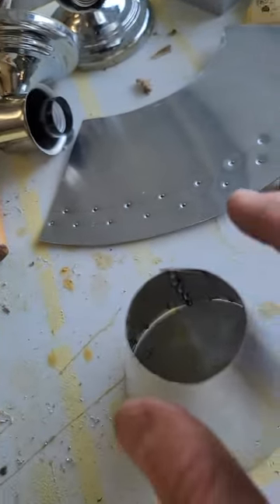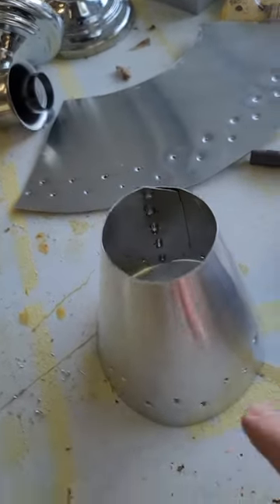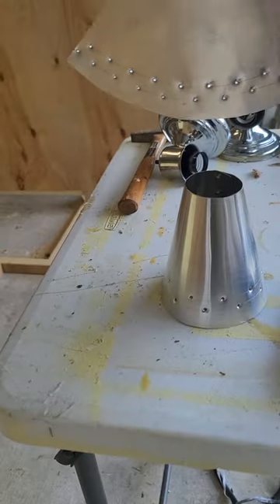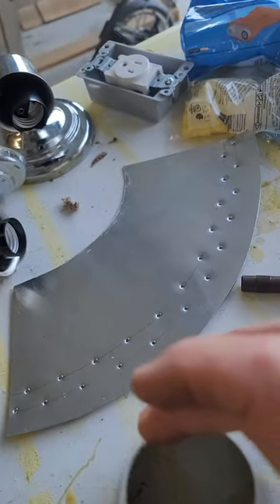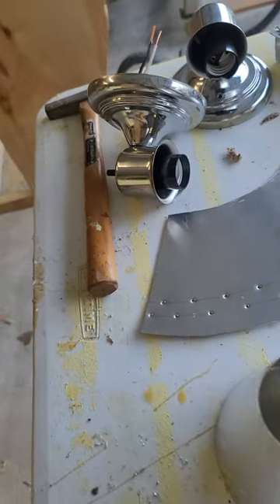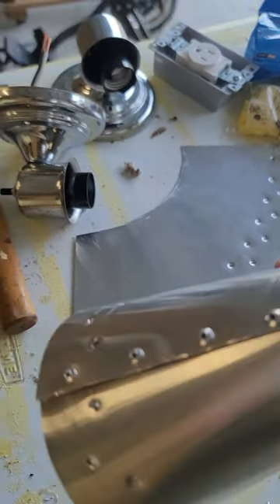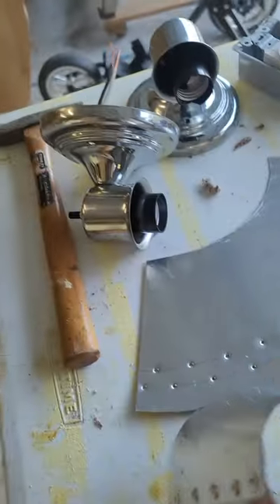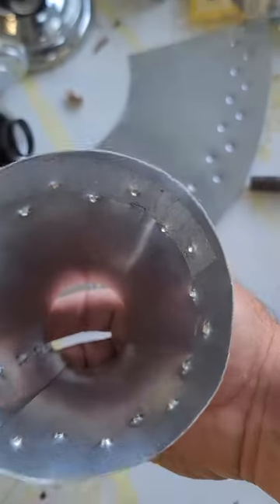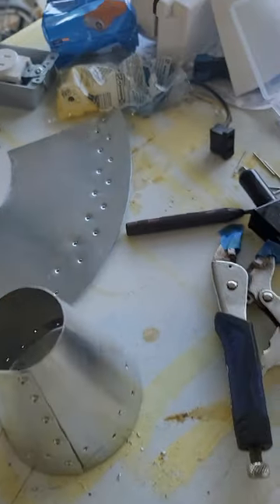Once I got this basic shape, bending the top along that smaller branch — more so than on the bottom for obvious reasons, because we've got to turn that into that. You don't just simply bend it in a circle and it gets there; you have to kind of work it. In my case, I worked from the top down. Once I got the two pieces close, I used my vice grips to clamp that edge together, which held the shape so I could fine-tune it — go along, make sure the top was round, the bottom was round. Then I drilled each of the holes, took my rivets, and put it together.